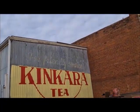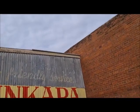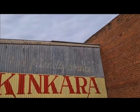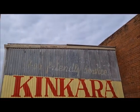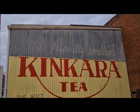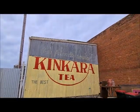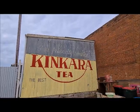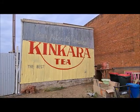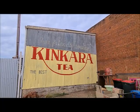Angus is going to get the sandpaper out, and he's going to go right across that bit of timber at the top and prep it, prime it, and get ready to paint it as well. I'm going to start cutting in the top letters, and we'll get the whole top first coated, and then, like I said yesterday, once that's done, we'll second coat from the top down until it's finished. I'm not sure whether we'll get it done today, but if we can get that top bit done, and maybe the red second coated today, happy days, which means we'll come back Thursday if it's not raining and finish it off. So righto, we'll get into it.